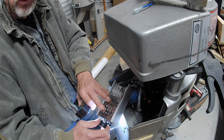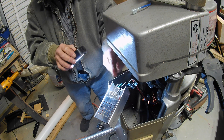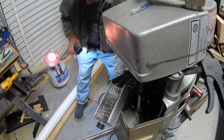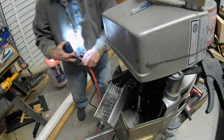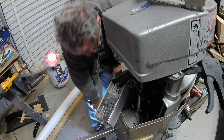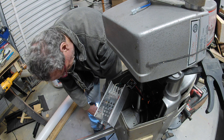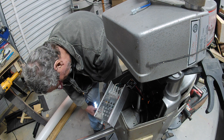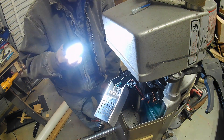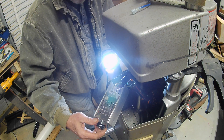This potentiometer here might need changing, so we're going to have to see what it does. We've got the rectifier hooked up there, and there to there, and then the SCR. We should be able to turn it on and get it to go. Now, I've got a little method I use when I'm going to do a test like this — I put the cord down on the ground and put my foot on it. And I'm going to plug this one in. If I need to jerk it out, I've got my foot on it to hold it down. I'm going to keep the cord in my hand in case I need to pull it, so I've got it ready to disconnect.